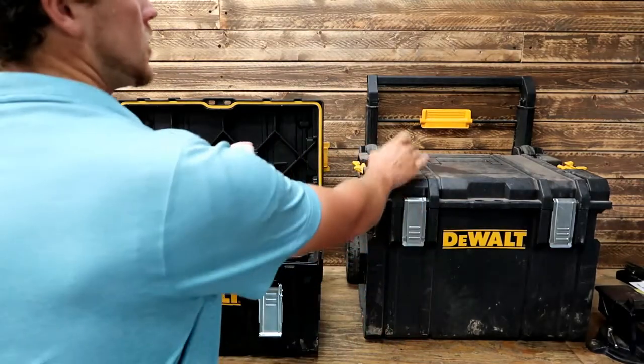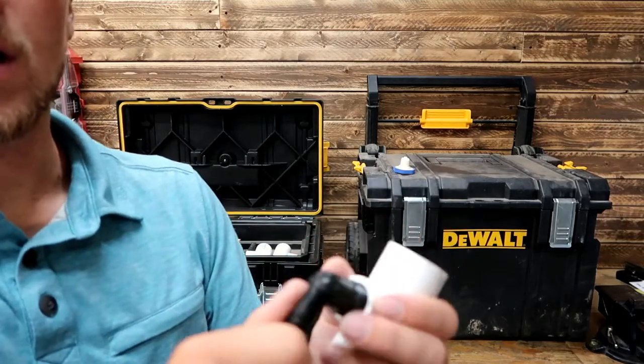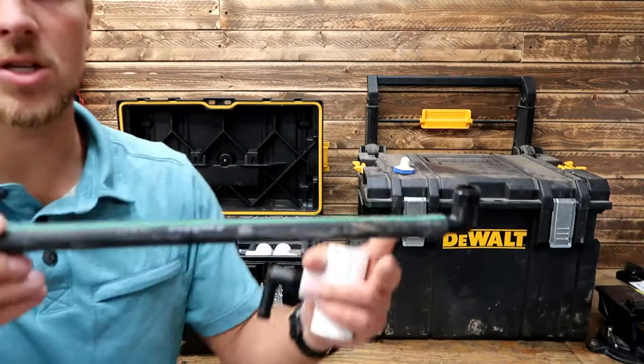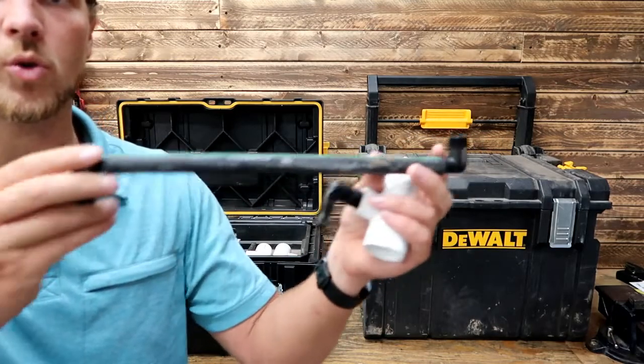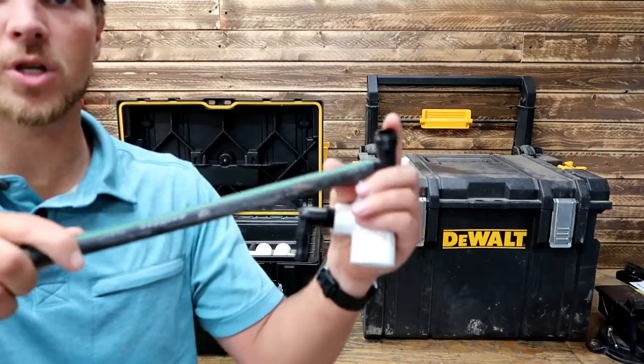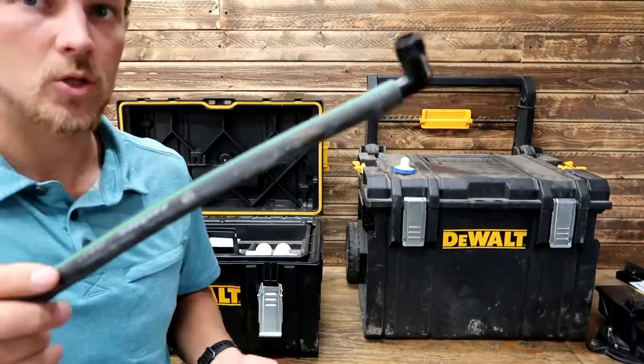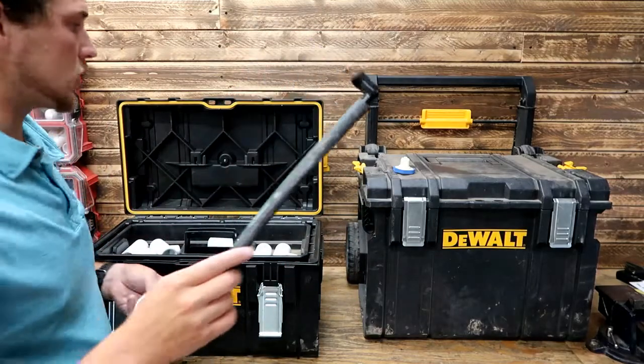And then we've also got our funny pipe elbow. These screw in there, and these connect to your funny pipe, which you screw one in the pipe, screw one in the head. This gives you a flexible solution of where your head's at. If somebody drives on top of the head, it's not going to break your pipe. So this is pretty common in new irrigation systems.